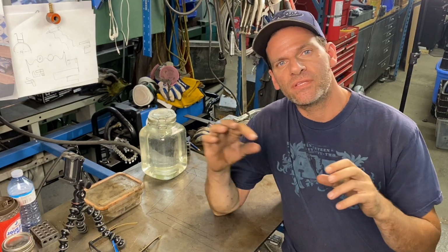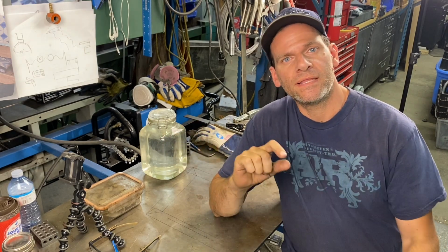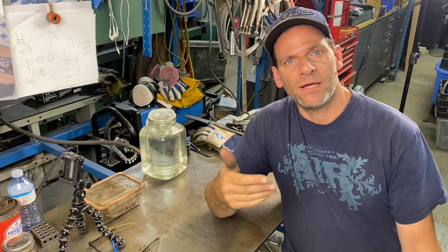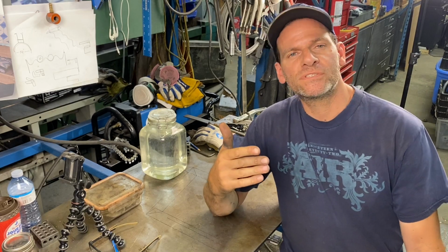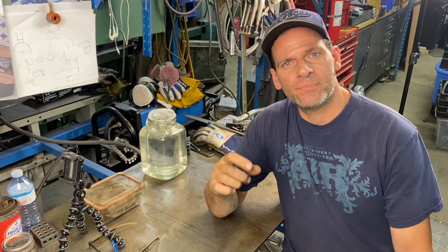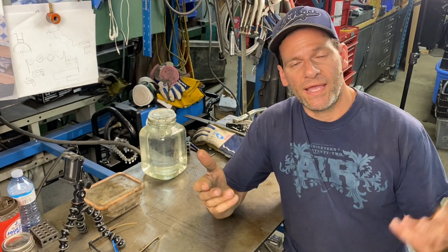So my idea for making a new type of Damascus pattern, this experiment, is I want to do a cutout, say like a square or a rectangle or even a triangle into the top of the Damascus billet and then forge it down, and hopefully we're going to get that shape showing up in the pattern. Now the most efficient way to make that shape is by using a CNC machine. So I have one available.